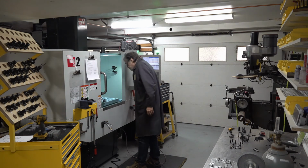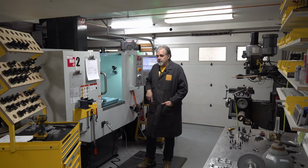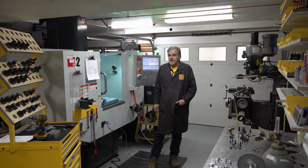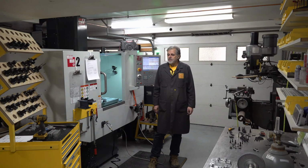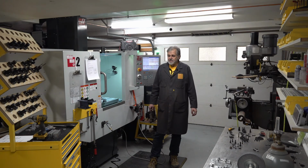So all is well. I'm going to turn off the camera, make a new tooling plate, probably on the Bridgeport. Believe it or not, as wonderful as this machine is, when I'm just making one part, the old Bridgeport is faster. 2-axis CNC is just faster and less error prone than 3-axis because if the XY goes wrong and I've got my hand on the Z, not going to be any trouble. So I'm going to turn the camera off, make some tooling plates, run the batch, and then come back and hopefully get this pig to oink.